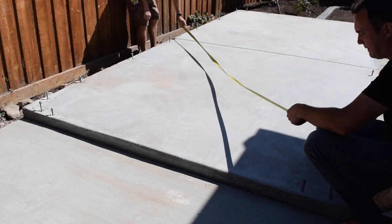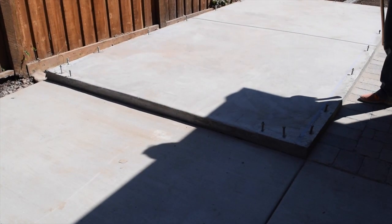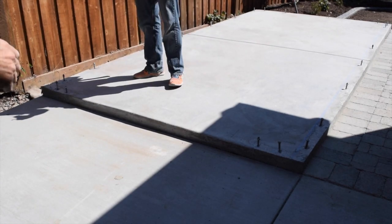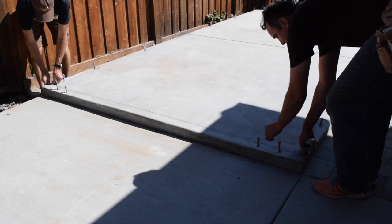We use an arching line because it is somewhere along the arch that we will find where the shorter wall intersects it and makes a right triangle. Finish making the end wall location mark by pulling a chalk line from the corner mark through the X where the 10-foot and 6-foot arching marks meet and snap the line.